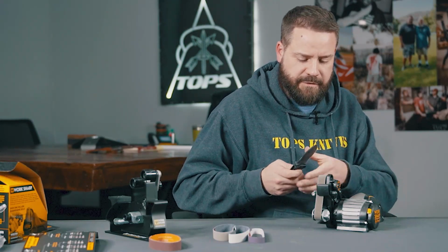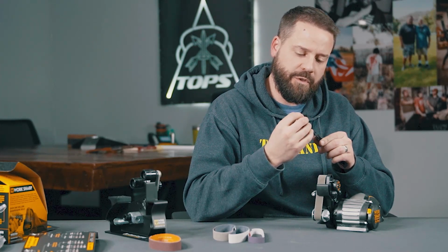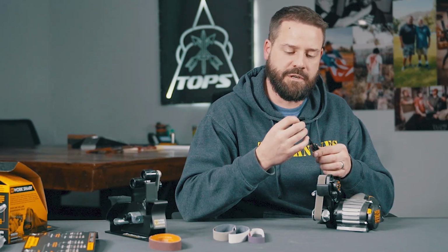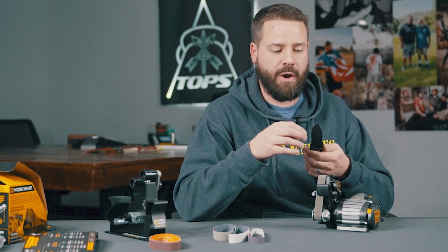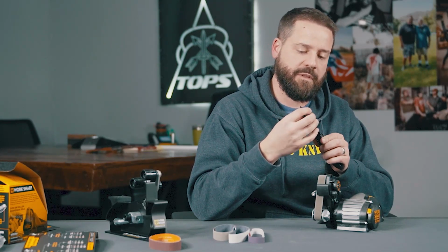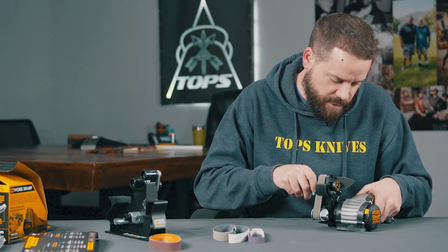Yep, just that last little bit. And another thing that's kind of cool with these systems is, when you're first learning how to resharpen, it's hard to know whether you're doing a good job, because it takes a while to raise a burr on a stone. On something like this, after only 3-4 passes, we've already raised a burr on a lot of this edge, and that tells you really fast what part of the knife you're not quite getting properly on the sharpener. So for me, on both the last system and on this system, I'm not quite getting the tips right. So that's a good thing to just notice while you're going through. You kind of check your own work. So we'll try this a few more times, try and get that tip good.